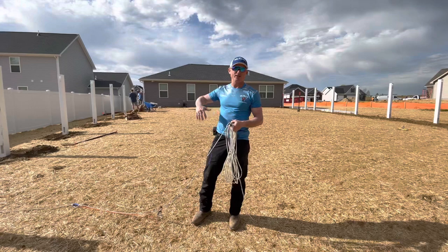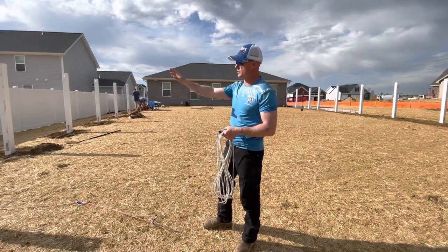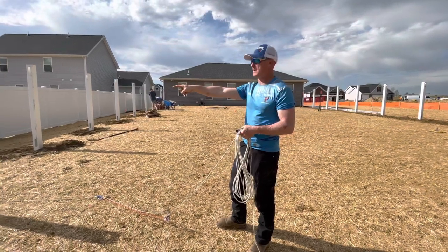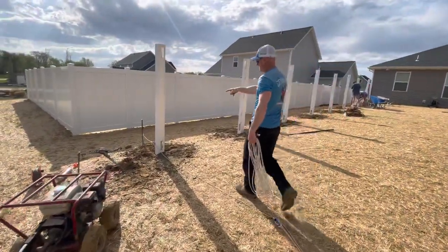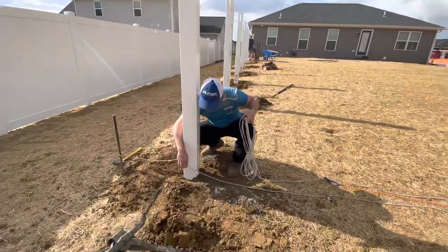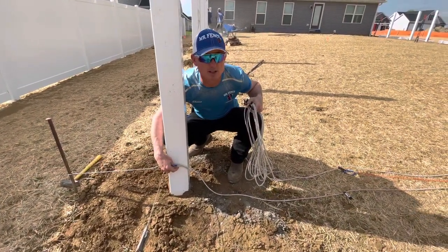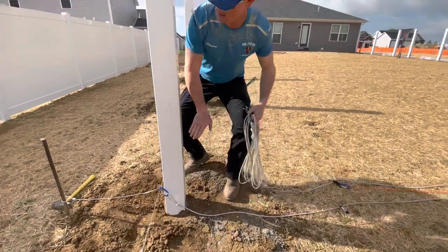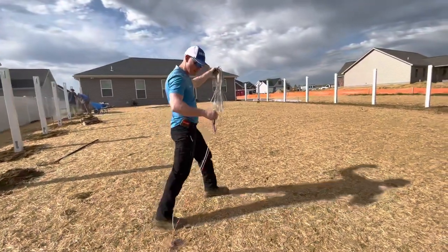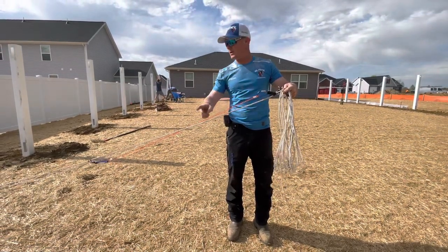This back line of fence here is approximately 50 foot from in-post to in-post. There's a gate in here that normally wants to be about two sections off of this first post. What I've done is I have a stake set over here. This stake is in the ground with my offset cable that comes with your Equalizer, so that the end of the Equalizer cord right here is in the center of this post — that's where I want to start. The offset cable is connected to that stake. I have one more stake at the other end. I also have a gate spacer cable — this is a four-foot gate spacer cable hooked in here, so it's four foot from carabiner to carabiner.